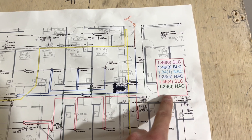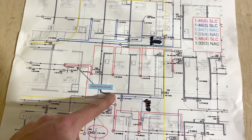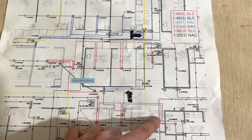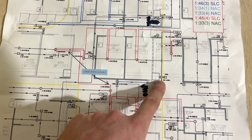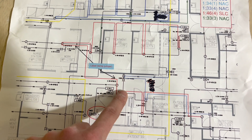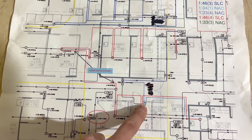The third one we did was the purple circuit, which started at the corner column, went down the cable tray, jumped into the fire alarm box, then jumped across the hallway, went down the other wall, and ended in the bathroom. That will eventually go out across into the PETs flex, but for right now it just goes from the column, hits the first device, jumps across the wall, goes down the other wall, and into the bathroom.